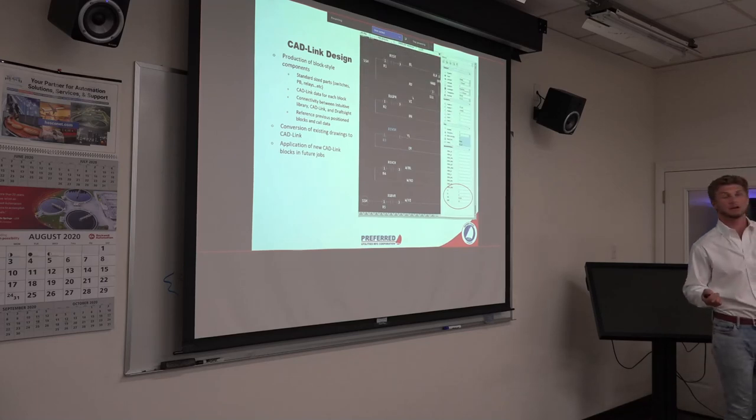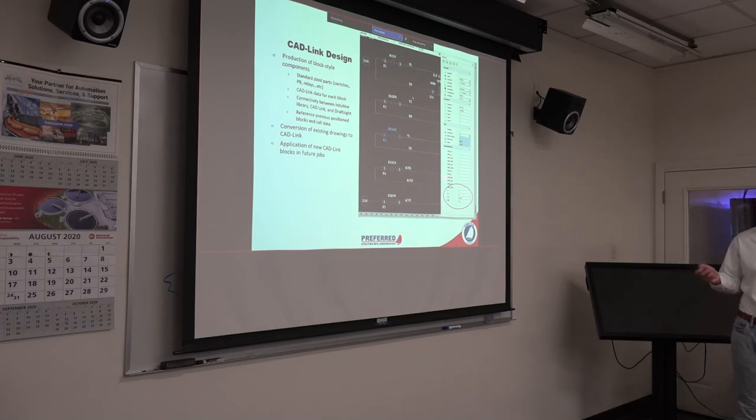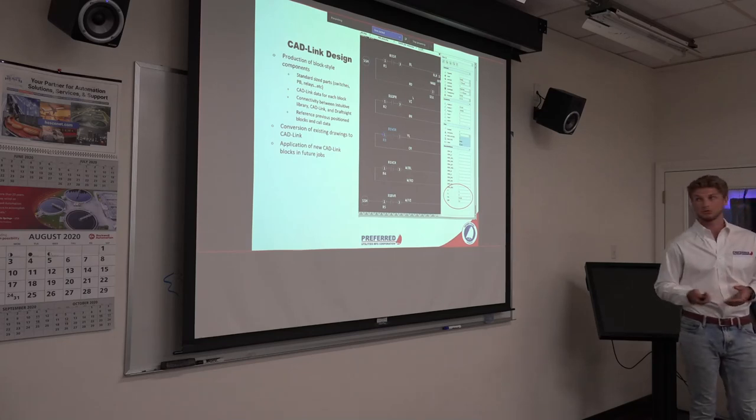Yes. So here also, these are normally open relays. Again, all of this data right here is generated in the block that you made prior. So whenever you run the insert command, you go through your library that we've built and find whatever you need, insert it, click enter a couple of times, maybe change a couple of properties around. So for instance, this B1 VOR, all the terminals for these should be the same, and then your reference coil here. And it just helps standardize everything that we're going to be doing in our drawing.